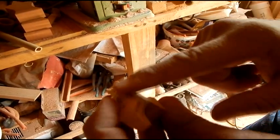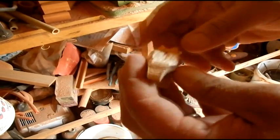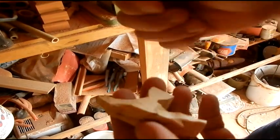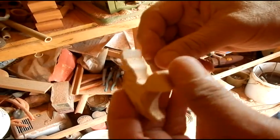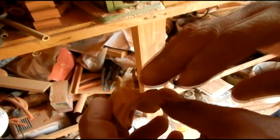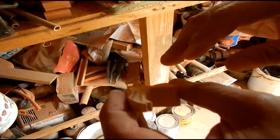And the reason I sanded these edges down is because if I'm using a power tool, I like to go ahead and let it do as much of the work as I can instead of having to come back and hand sand all that. That saved me a second or two worth of hand sanding, which when you make thousands and thousands of flutes, that's pretty helpful. Anyway, so I'm going to come back in, sit down, and start sanding this guy with sandpaper, which is how I'm going to finish it out.